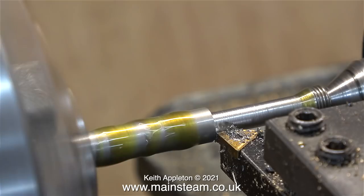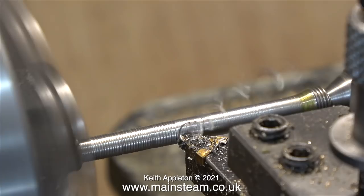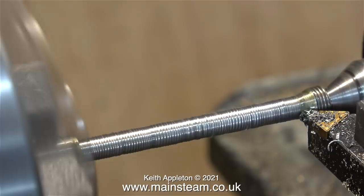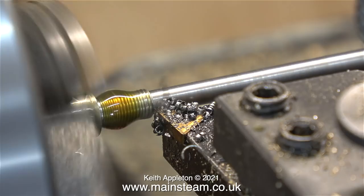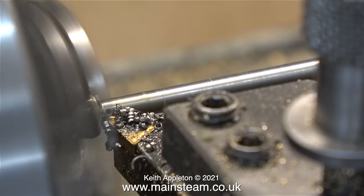The cutting tool I'm using is still quite sharp, so I'm actually taking quite a deep cut for such a thin shaft. The further away the cutting tool gets from the live center, you can see rings starting to appear. Eventually I reach the other end — this is an exercise in patience, you can't do it too fast. This is removing quite a lot of material so on the next cut the cutting tool won't have to work quite as hard. This part isn't going to be particularly accurate, nor does it need to be — it's just a pin for the hinge of a miniature steam locomotive.